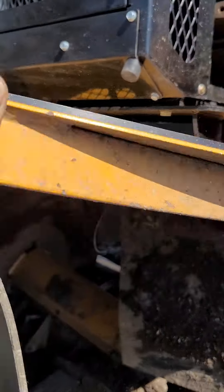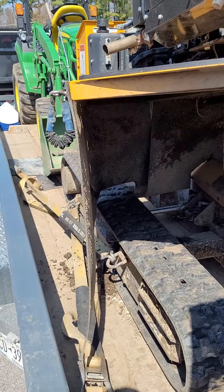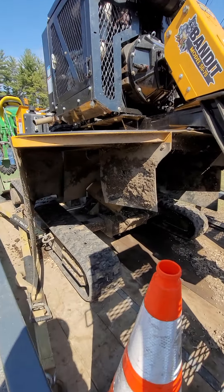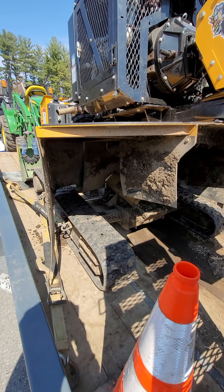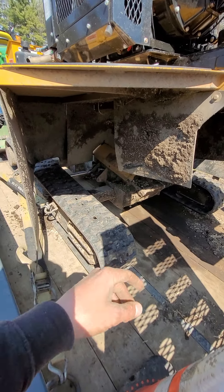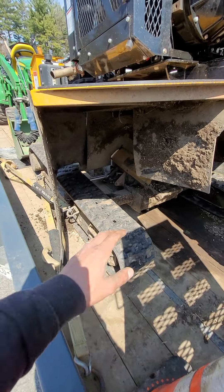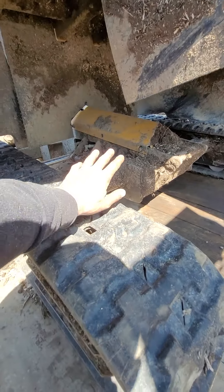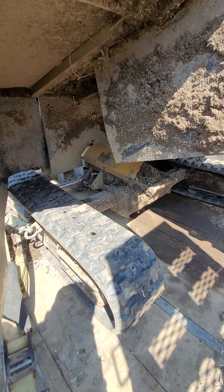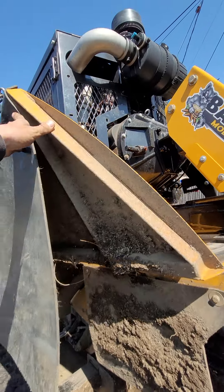I do like the curtains. The chip containment on this machine is insane — it really keeps the chips in and you don't have to clean out unless it's very large stumps. It just eats chips and it's real nice. Before I finish up the stump or if I've got to clean out, I'll clean the machine's undercarriage and then walk it off. If you don't, it'll leave a trail for 5, 10, 50 feet. There's just a lot of material that builds up underneath. So you really got to wipe this off with a leaf blower or your hand, or you're going to drag chips everywhere. These bat-wing curtains are really nice, I like them.